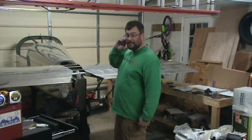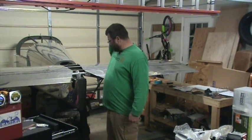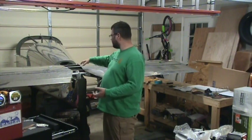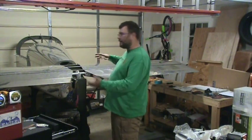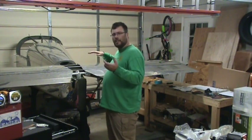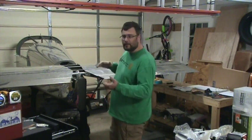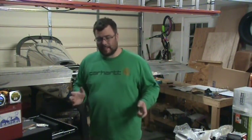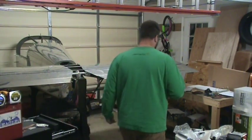As far as I can tell, you have to feed those cables in that way. So while I could take the horizontal stabilizer off and remove it fairly easy, installing, somebody would have to hold and move forward with the horizontal stabilizer while somebody else was routing the cables through as you move forward. So it'd be a pain in the butt. So it's just easier that when I disassemble it, I take it apart exactly the same way it went together.